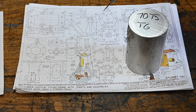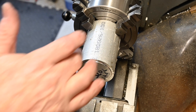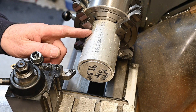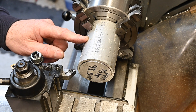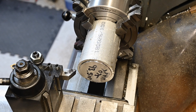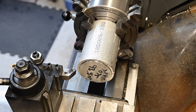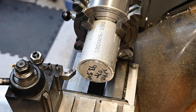We've got the 7075 T6 in here. We've got to machine it down — the flange is 52 millimeters and the rest of the stock is 32 millimeters. So we'll get it faced off to start with, then I'm going to drill out and put the tailstock in to give it a bit more support. There's quite a bit sticking out and it's a big lump, but that'll hopefully stop the chatter. Let's get stuck in.